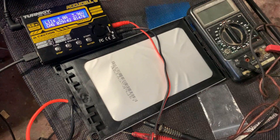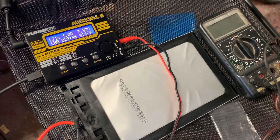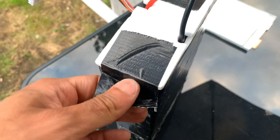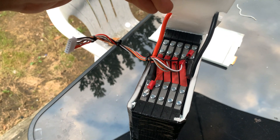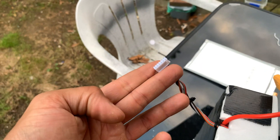As you can see here, this is where I snapped the copper end off — you can't solder that. So here's the new battery, fully charged and then discharged to match the rest of the pack. This is how I connected up the packs: bus bars covered with a 5s balance lead. The shop didn't have any 5s, so I bought a 6s and chopped it down — the colors might not match but I've tested every single balance connection point to point to verify it goes to the correct cells.